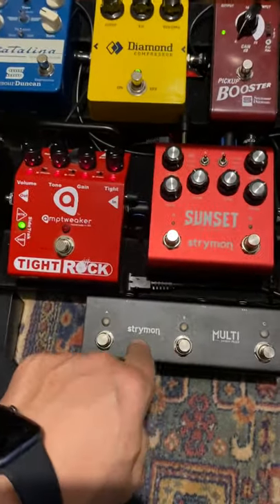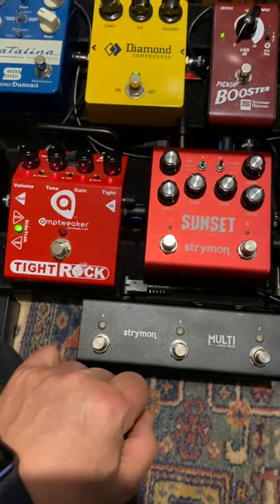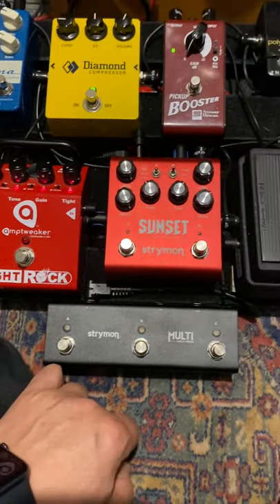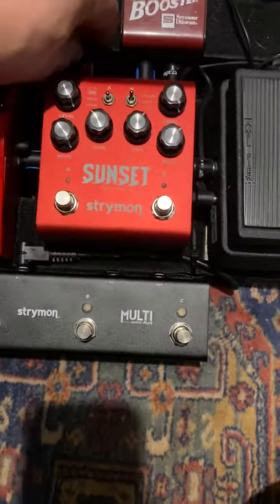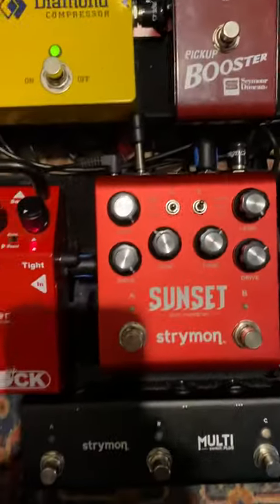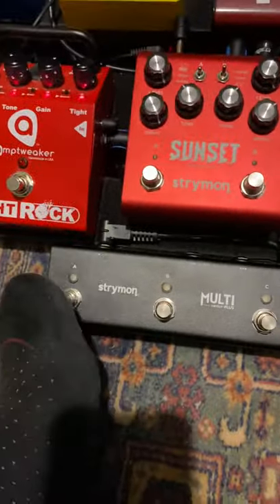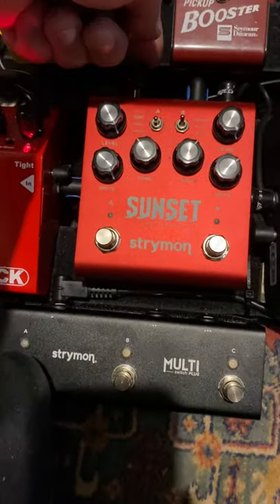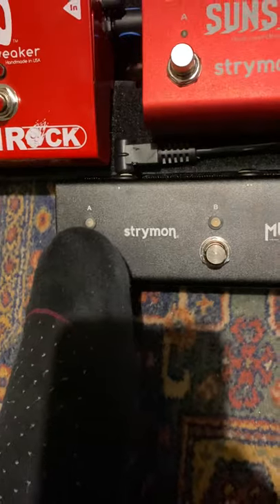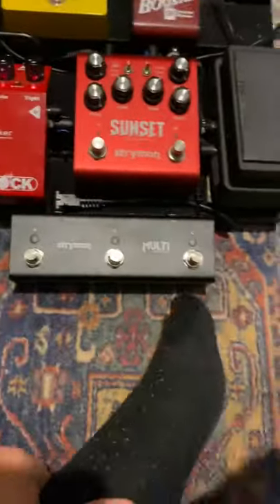Now I'm going to make sure that the Multi Switch Plus is in preset mode. When I connect it to the pedal — it's unconnected now — I push the A button and keep it in while I plug in. I'm going to use my foot. So red light, the diode blinks a little when I release it, everything goes green, and now it should work.